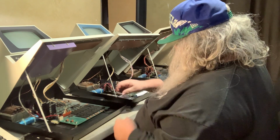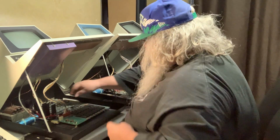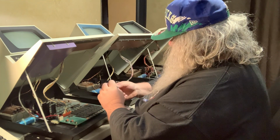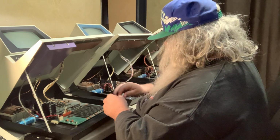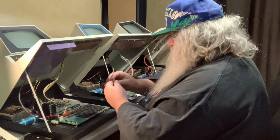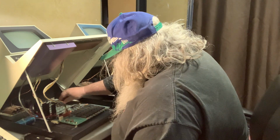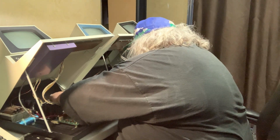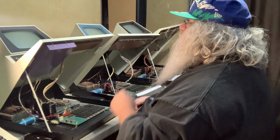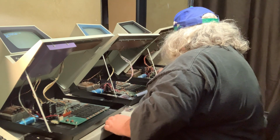All right, so check the pins, check the witness mark. The machine is off. RAM chip out. Witness mark at the bottom. Pins are looking good. Secondary glasses, not quite as strong as others, are on. Almost put it in backwards. Almost. Check the pins. Line it up carefully. Push it in. Visual inspection. Turn it on. Okay. That went well. Good.